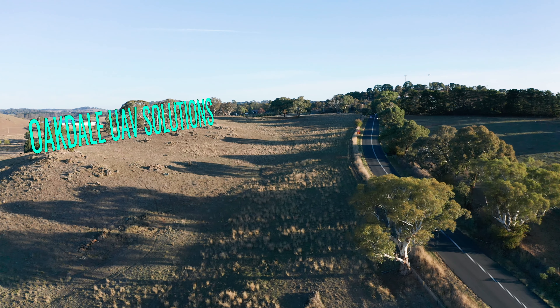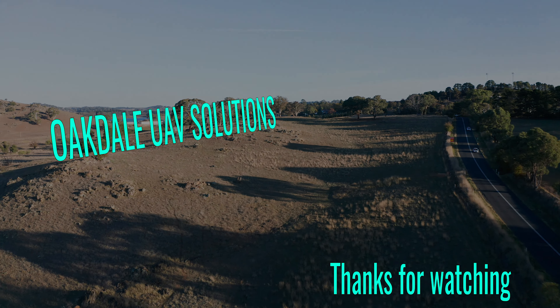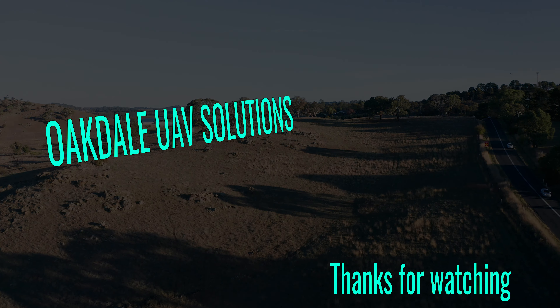This camera is capable of 12 megapixel stills, where other multi-spectral cameras are between 2 and 8 megapixels. The AGX-710's mapping efficiency varies widely depending on the plant species. For cereal crops, about 150 acres or 60 hectares per flight is achievable. But where I grew up in the wheat belt of New South Wales, Australia, it's nothing out of the ordinary to have between 2,000 and 10,000 acre farms, so you can imagine the amount of batteries you'd need.